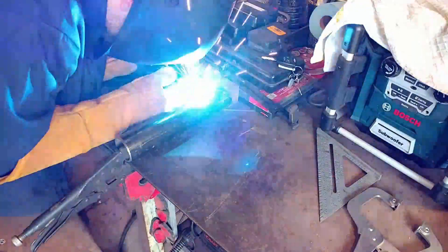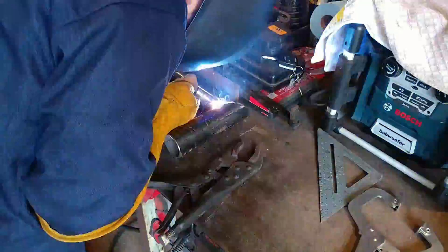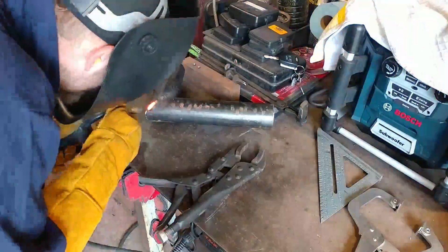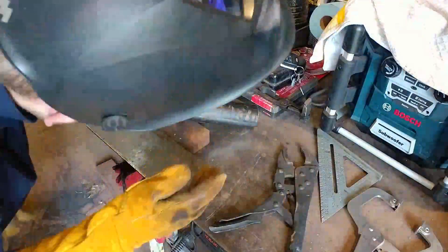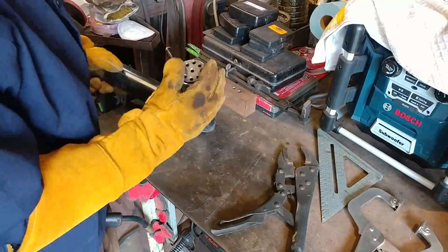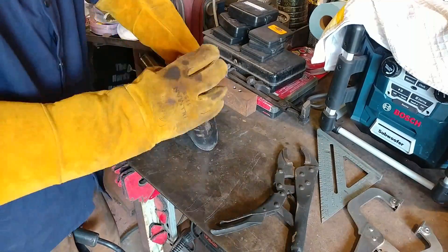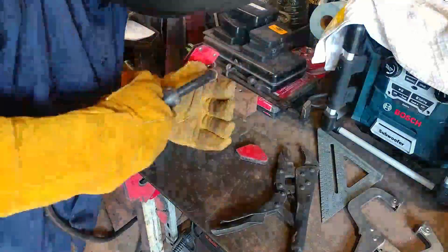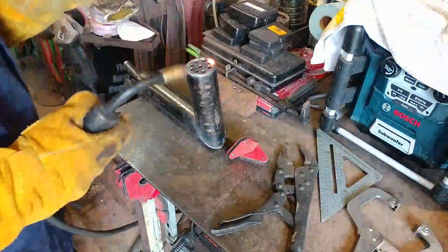What you don't see in here is that I did not miter my cuts very well, so it left more of a gap in the heel of the pipe versus the toe of the pipe. I was still able to get it welded up the same — I just had to add in a little more filler. Now we're going to go ahead and get this piece set in. I'm using a magnet here. I wanted this particular bit to be on the very flush front face because I'm going to add a burner flare to it later.